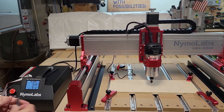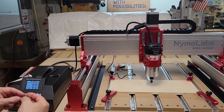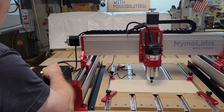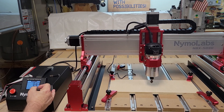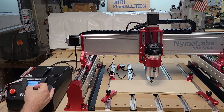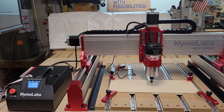On a desktop computer just out of shot, I've used VCarve Pro to create a little sample VCarve program, and I've already put that on the SD card. Let's pop the SD card in. Now we'll go to this file, go to SD storage, and I'll hit the one I just created called VCarve Test. I'll highlight it and send it to local storage so it won't be running off the SD card. It copies the files in just a few seconds.